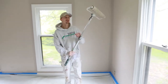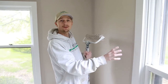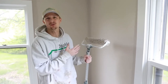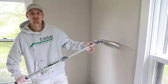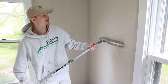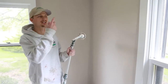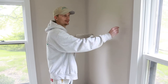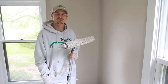When you start your roller, you don't want to get too close to the trim right away when you first lay on the paint, because if you get too close there's nowhere for that excess paint to go — you can't roll it out. You really want to start a little bit away from any trim or the next wall, so you have the ability to come back through and flatten out what we call 'ropes,' which is where the paint starts to sag down the wall. Just fixing any of those inconsistencies.